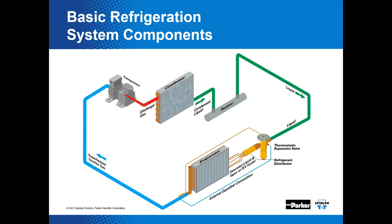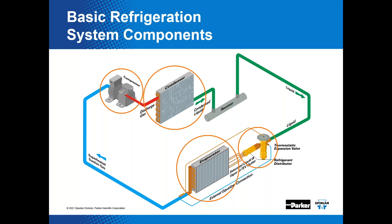Here's the basic, perhaps idealized, perfect vapor compression refrigeration cycle — no pressure drop, isentropic compression, and all that. We mostly show this to depict the four primary components: the compressor, the condenser, a metering device, and an evaporator. Every vapor compression refrigeration cycle must have those four components in order to work.